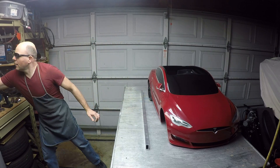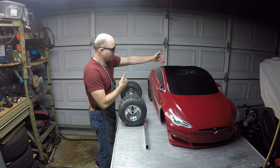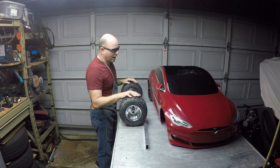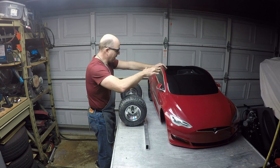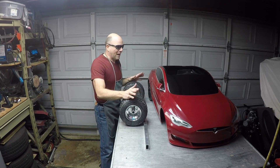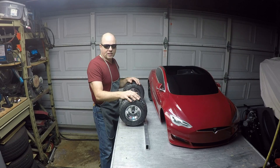Yesterday I assembled the rear axle. So the first thing to do is to lay out the Mini Model S, remove the rear drive unit, get the axle set for the right width for inside the car. I'll have to cut out some of the inside of the car as well, then trace the body directly on the table with a marker for component positioning. I'm not going to draw detailed plans — I rarely draw anything when I build. I just start building with a mental picture and let mechanical interferences dictate where I go.